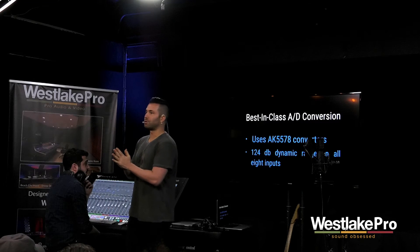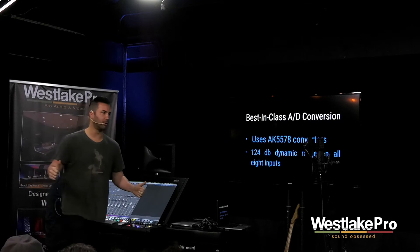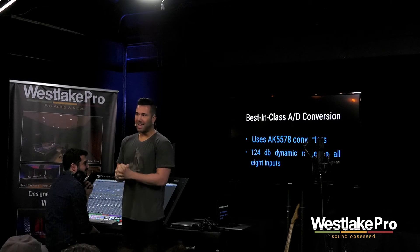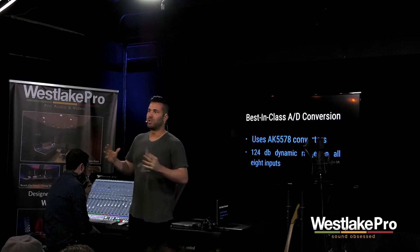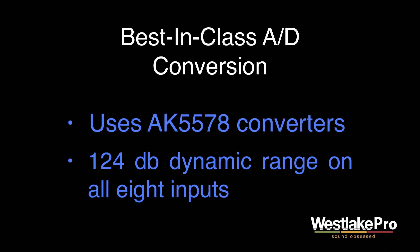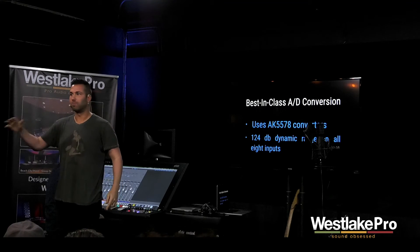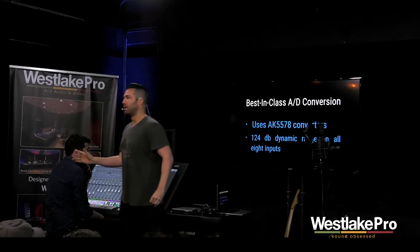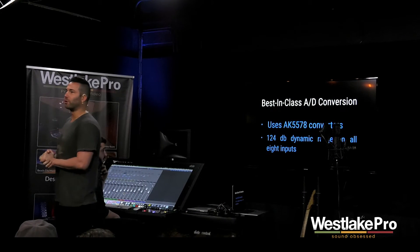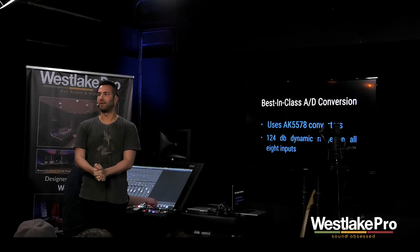So the first slide is about the A-to-D conversion — we're going to get geeky and talk about some components. The A-to-D's and D-to-A's on any converter are obviously important. We use the top-of-the-line AKM 5578 converters, up to 124 dB SNR on the ADC — the DACs are 123 dB. This is far above what the competition is doing. A really great A-to-D chip is important, but it's not the most important thing for an entire audio interface that sounds amazing.